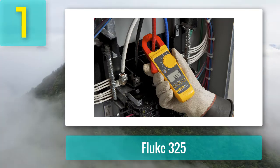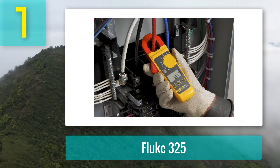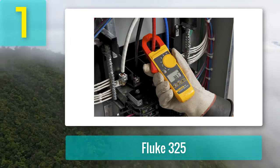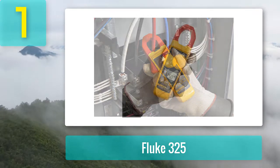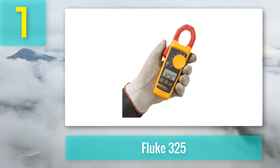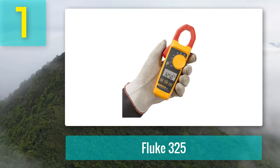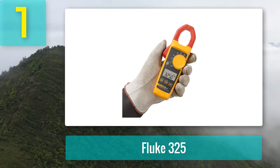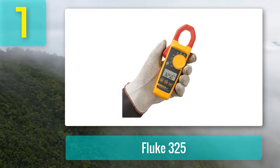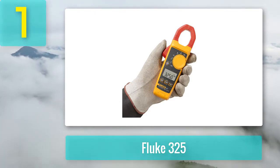With those jaws, you can comfortably measure the current without interrupting the power. The safety is a no-brainer because the Fluke 325 meets many safety ratings like CAT 4, CAT 3, and IEC 61010-1 standard. The meter features true RMS technology to display current readings as accurately as possible regardless of complicated and fluctuating sine waves. It is no surprise that this multimeter is the best HVAC clamp meter for residential and commercial projects. The only downside is that the meter has a minor grip and buttons, making it difficult to adjust with a big hand.